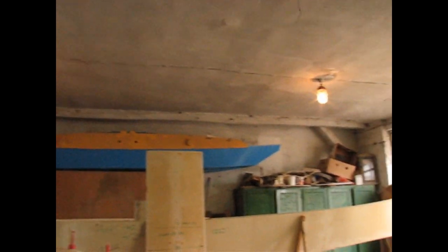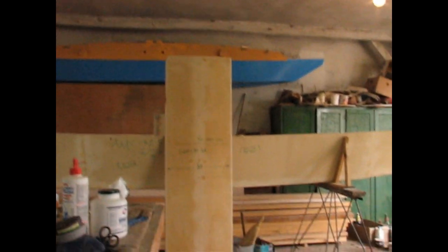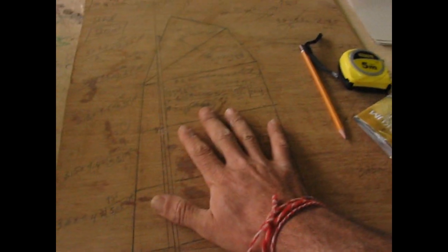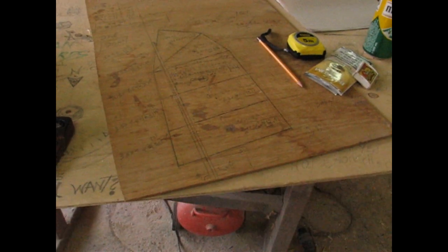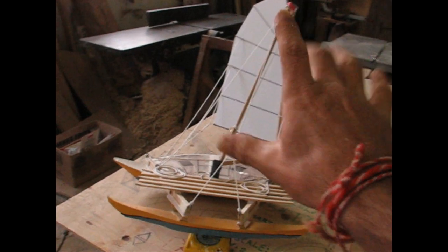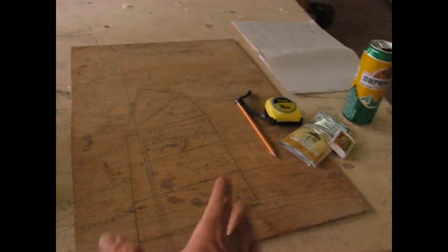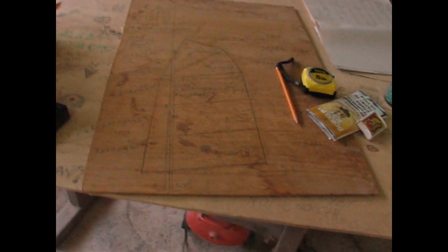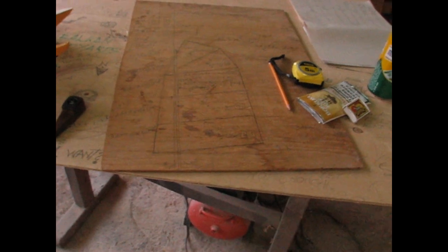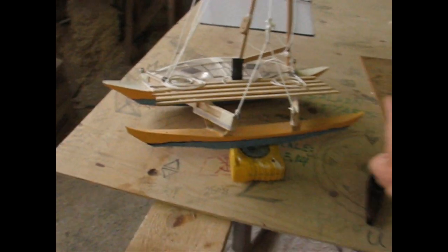Big dagger — 3% of sail area. My sail area is 20 square meters. Here's my junk rig cambered panel — five-panel junk sail. Here's the Avaya 30. This is a low aspect compared to what came out of here, which is a higher aspect ratio — and I'm much happier with this sail. It's 20 square meters and this thing will go to windward. It's a good high aspect ratio rig.